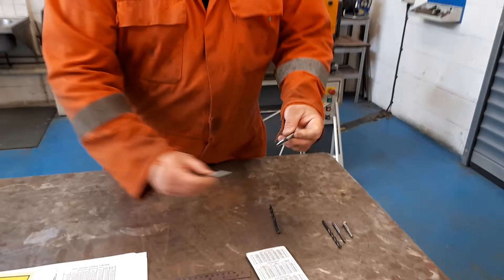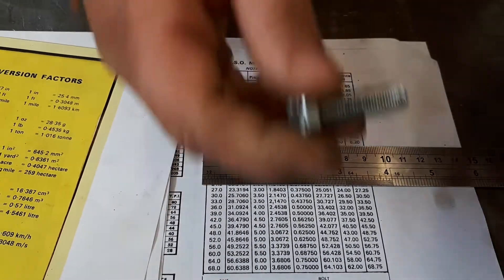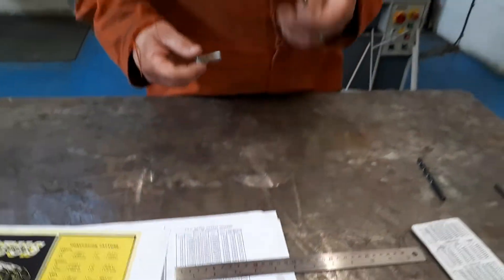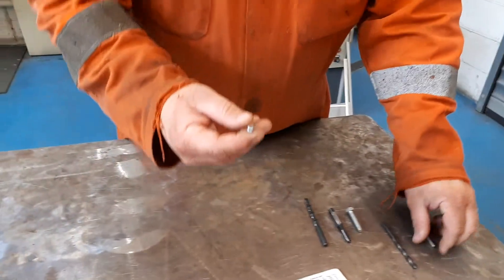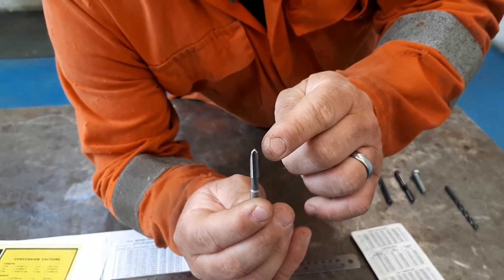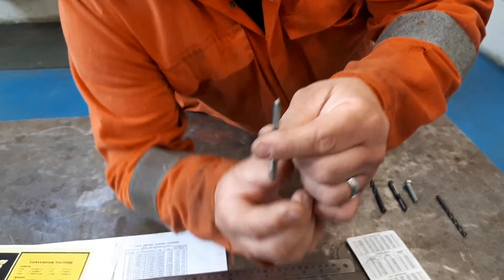One of the other things in the booklet is about pitch. The pitch for M8 is 1.25mm. You can always offer up a bolt and check — you can also get a thread gauge to check the pitch of the bolt itself to work out what size tap you require. For M6, this is a second tap, which means it has a slight fluting on the leading edge. A first tap would have a steeper taper; a second is not quite as steep, but for tapping mild steel or aluminium it's more than capable of tapping straight with a second rather than needing a first.